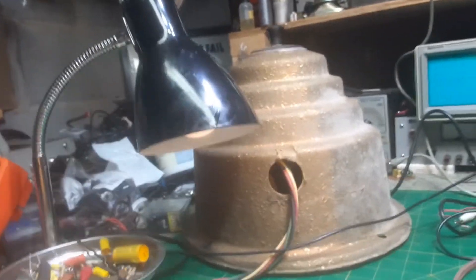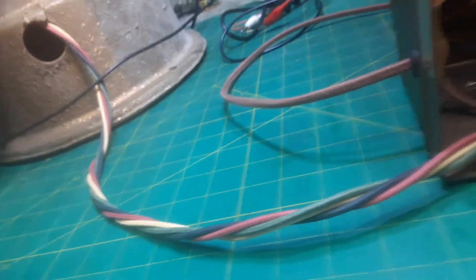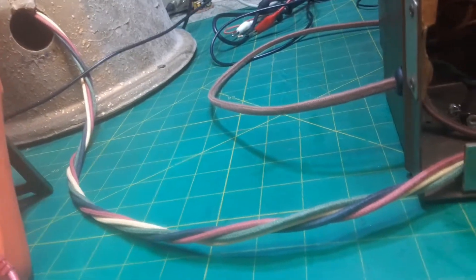This dog bone was fine. I put a transformer in to drop the voltage for mains, put a new speaker cord in, and finished redoing the field coil. The field coil is working fine now. Actually, the speaker works really well, which you'll get to hear when I put it back in its case.